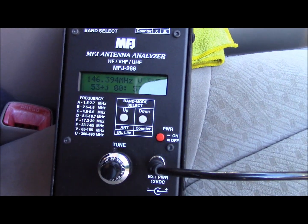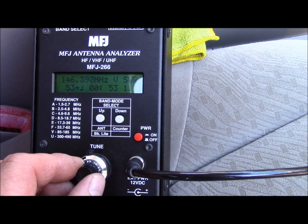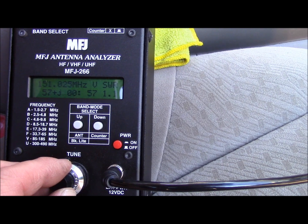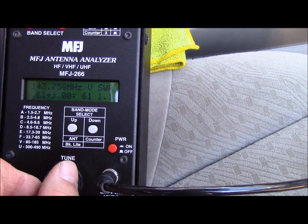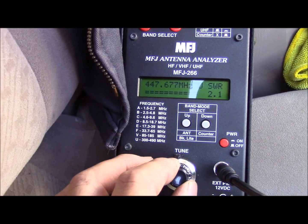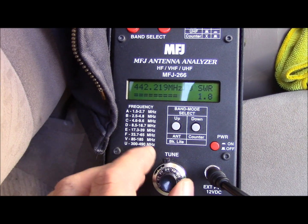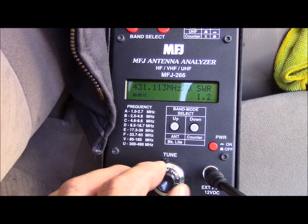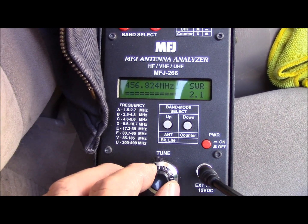You can see that our little homemade antenna here — our band-switch antenna — that VHF is right on without having to do any trimming at all. You can see it covers well in and out of the ham bands. And at UHF, it's giving us about 2-to-1, and it seems to be resonant around 427 MHz. Look how broad-banded that thing is at UHF.